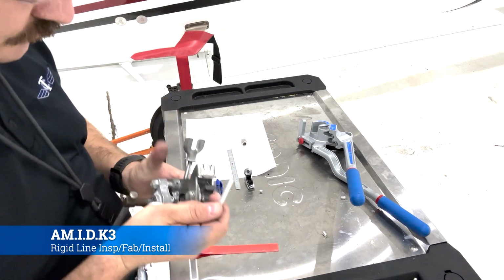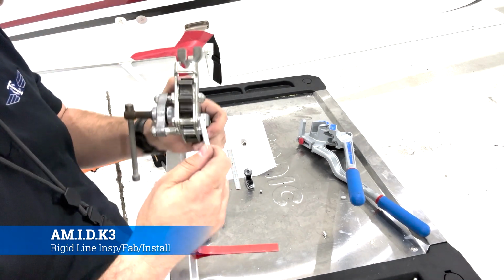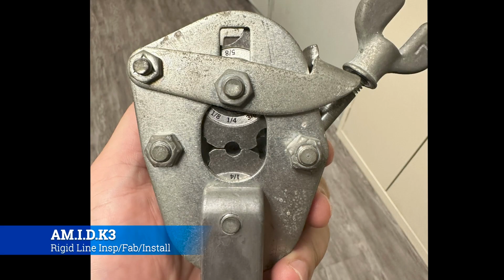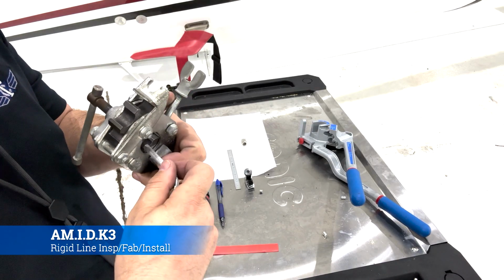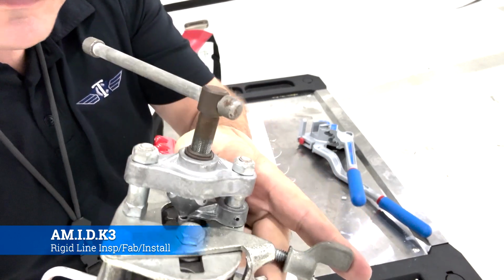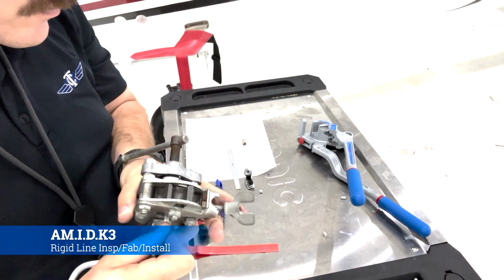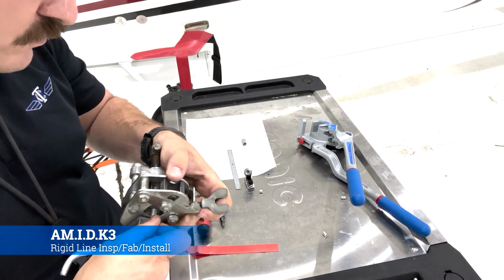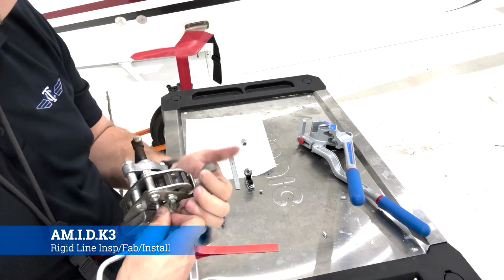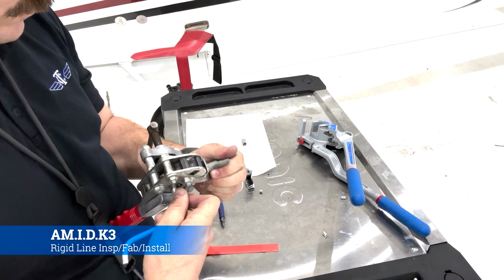We'll take our tube and our flaring tool. This flaring tool, there's 2 dies on the back side that you'll match up to the size of the tube. And then once it's fully sat on the little crow's beak stopper, we're going to latch it down. We'll latch those 2 dies down and tighten it up to keep the rigid tube in place.